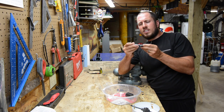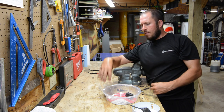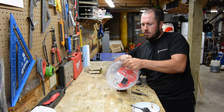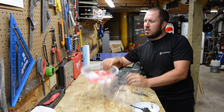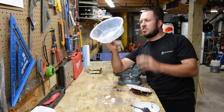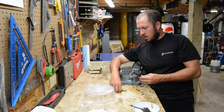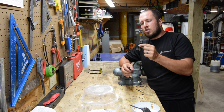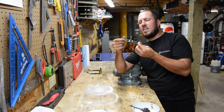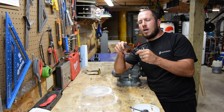We're going to demonstrate this and show you exactly how it works — we'll even drill some drywall overhead. The kit comes with its own dust shield. The tool has two knives on it that can be replaced; you could grind a new edge on them, technically even a sharper one. It's a pretty simple design — as you want to make the hole bigger, just pull the knives further apart. Once you insert the drill bit, which has a hex key, it keeps the blades from moving so you can no longer adjust them.